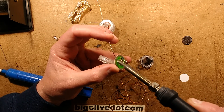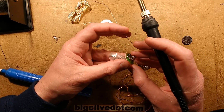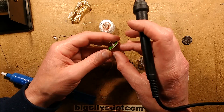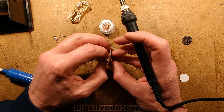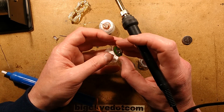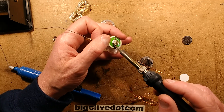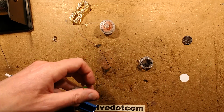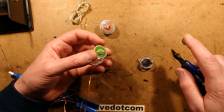Let's get the solder in on that. Let's see if I can solder onto the bit I'd cleared — I think I've managed to do that. The other wire goes to the other side. I like this idea, particularly if you use rechargeable 2032s. This one has a resistor in series as well — the other one didn't — so that should make it run a bit dimmer but last a lot longer. That looks pretty good. I'm going to trim the tops of those wires down so the battery doesn't squish against them when closed.